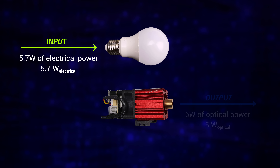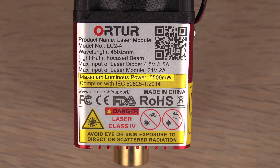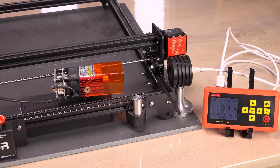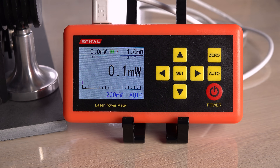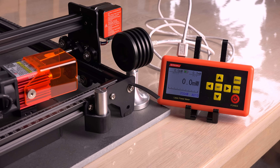It just doesn't apply to lasers. For lasers it is usually the output of optical power that is listed — a measure of the power of the light coming from the laser, not how much electricity it uses to generate the light. However, to add to the confusion, it is now common for laser engravers to list the input of electrical power to the laser. Let me demonstrate using this laser engraver/cutter. On the label it says maximum luminous power 5,500 mW — strictly speaking it should say max optical power. 5,500 mW is equal to 5.5 watts. Let's test on my laser power meter how strong it really is. I set the laser power meter to match the laser's wavelength around 450 nm for best calibration. For aiming the laser I use the focus function in the laser control program — this will turn the laser on at only 3% of max power, making it much safer to set up.